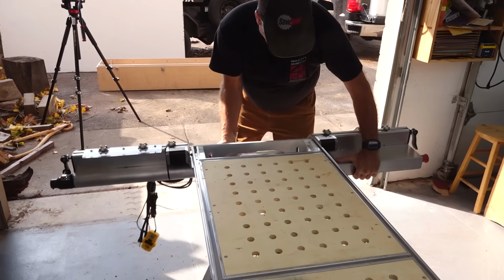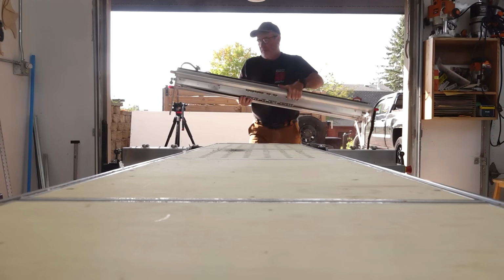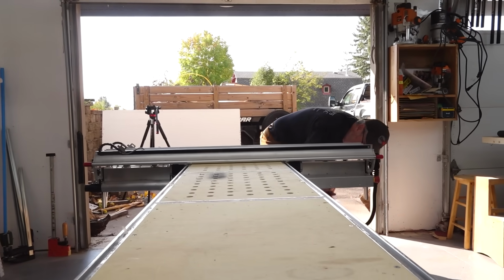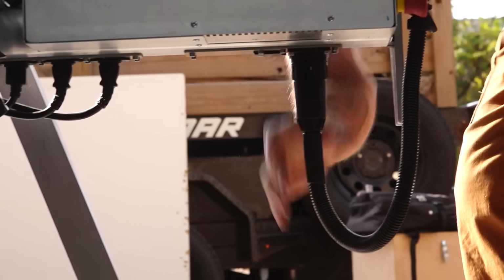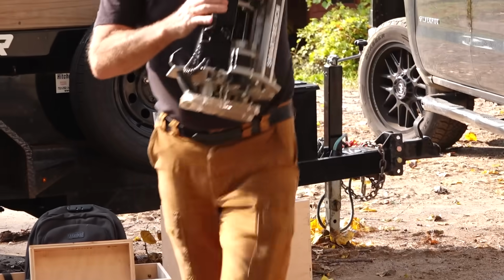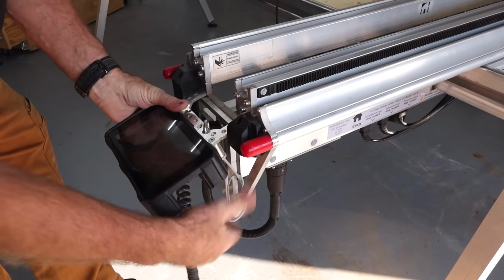We had one company out of California looking at one of these at a recent show. They said their jobs are 2 to 3 hours from the shop and they need a single part. They can throw this on a job site trailer, and if they need a part, they can take the software. We're using Mosaic for these cabinets. They can cut that part out, or a cabinet that didn't fit, and they're not trying to get one single cabinet back into a production line.